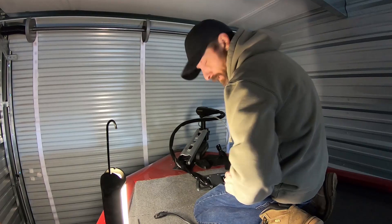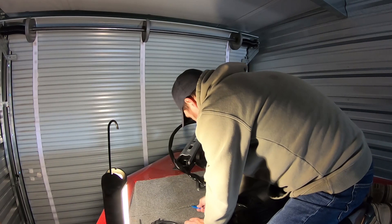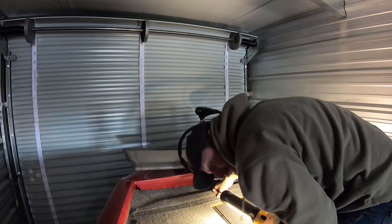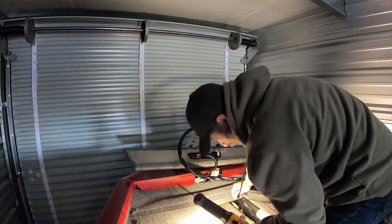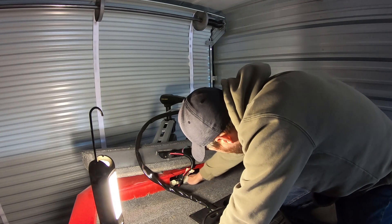I'm going to remove this panel and see what's under there. After a little bit of digging and searching, a friend of mine who has the same boat said he found his up in this part — the extra wire to tap into. I removed the tray and there was nothing there, but after sticking my head down in where the poles go, I managed to find it. I'll end up pulling that back up through here. There's my power right there.